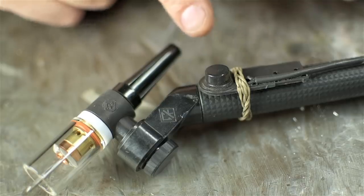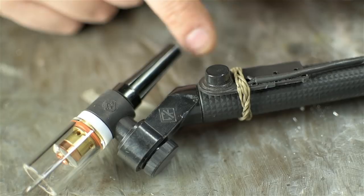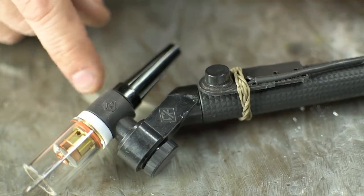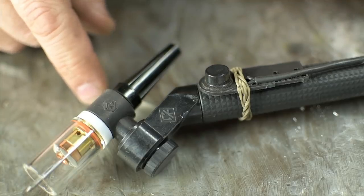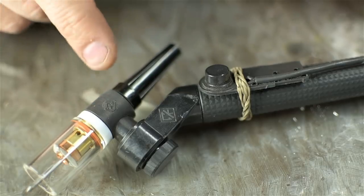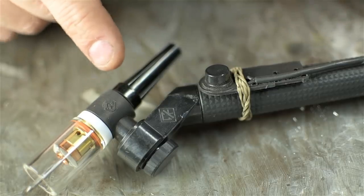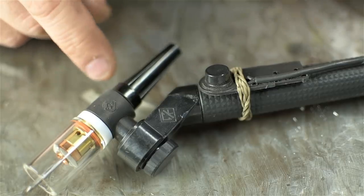However, getting a handle on the low end seems to be, for me anyway. I suppose it comes down to needing more time on it. But that bottom end, I don't know, 25 or 30% of the range is tricky to hold on to. And when you're tapering off at the end, you really do need to let the button go. It's quite sensitive, and more often than not, I end up just hanging out at 4 or 5 amps expecting the machine to shut off, and it doesn't.